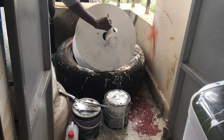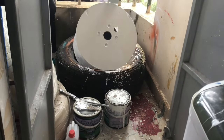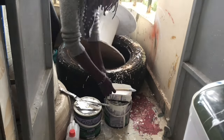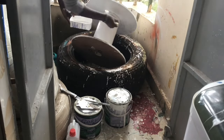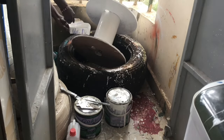This is my second layer. For the second layer, I made sure I added thinner. You can see it dripping because it's a bit lighter. But also when it comes to wood, wood soaks in paint — that's where you need to start with a thick paint. The second layer, make it a bit lighter, and then we will go to the third layer.